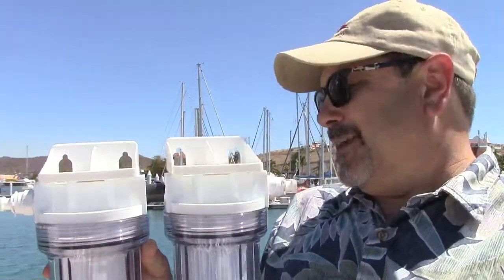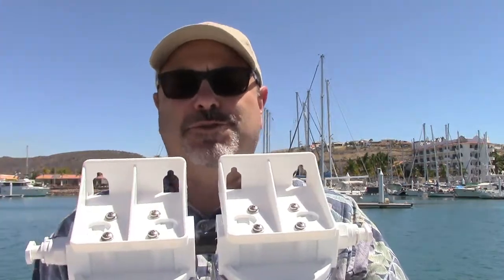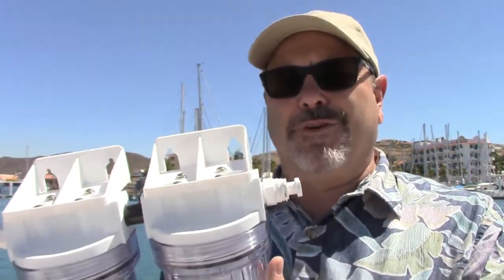The reason being, you'll see 'in' and 'out' written on the top of the filter canister tops. If you change the direction, you'll be filtering particulates from the inside outside of the filter and you'll never see the filter get dirty — it'll just plate up on the inside. So pay attention to flow direction. If you need it to flow in the opposite direction, that's very easy: just remove the eight stainless steel screws, four apiece on the top of the mounting brackets, and turn them around. That will change the flow direction of the pre-filter elements.